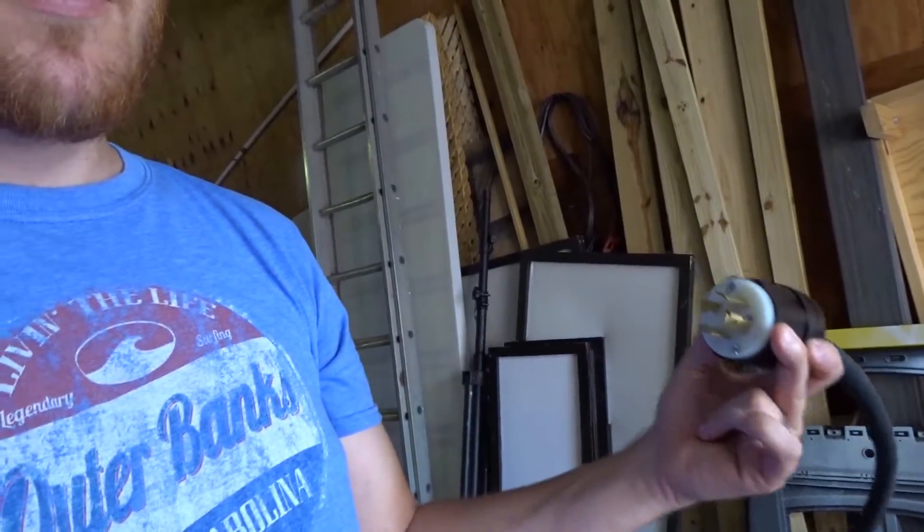I have one large cable that all my equipment can be powered off, and all the grounds are bonded, so ground loops won't be a problem. I can have all of that on a plug on a house. Another option — I don't recommend this — if I roll up somewhere with a dryer socket, those are typically breakered at 30 amps. I can make an adapter from this L14-30 to a dryer plug, plug in, and have power to my distro. I know the dryer circuit is dedicated and clean — there won't be shop lights or big amps on the same circuit.